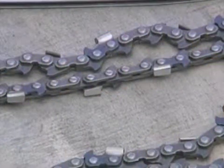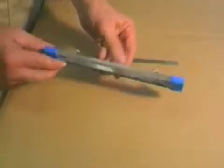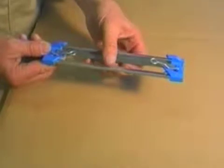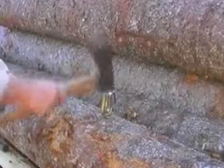For smooth, correct sawing, the chain must be really sharp. The filing angle on splitting chains is only 10 degrees. For the best results, Logosol recommends a filing gauge with 2 files, usually called a double file. When you use a double file, you adjust the height of the depth gauge at the same time as you sharpen the cutter. Sinking a simple saw vise into a log or stump simplifies the filing.